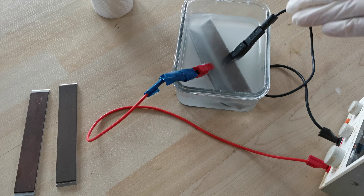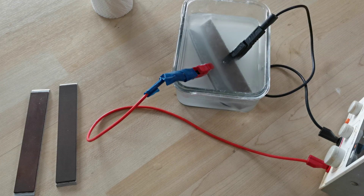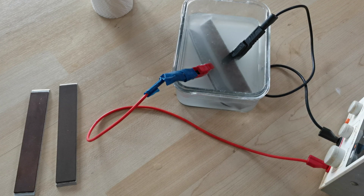It works very well, and exactly because it doesn't involve any acids or toxic substances, I really like this method. It's fast and you don't have to be constantly involved — just stay close to it. One thing I'd like to mention: this method can also be used for removing rust. When you do it with rust, which is iron-based, some hydrogen gas can form. Hydrogen is non-toxic but very flammable as a gas. I don't see much of this being created here, but just to be sure, do it in a well-ventilated area and stay in proximity.